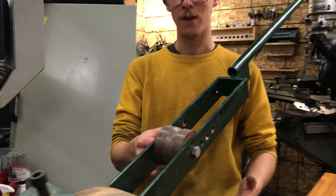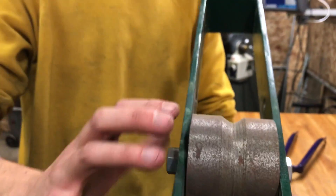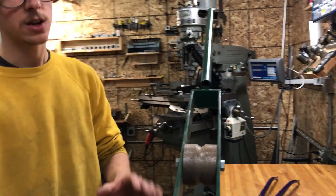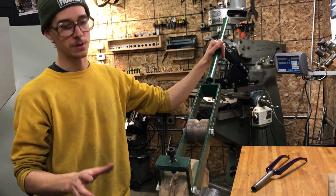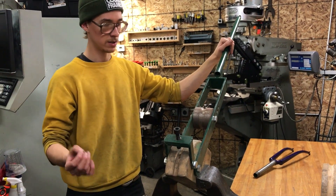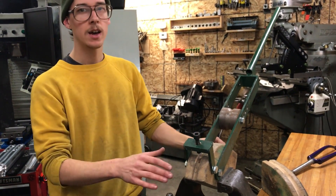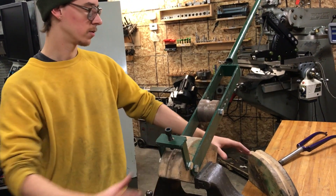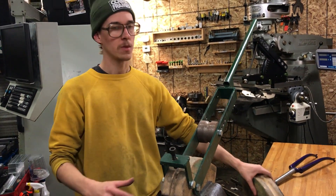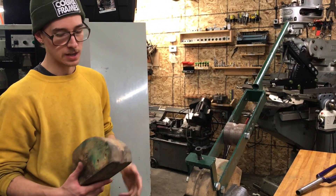These holes are just drilled on a drill press, they don't have the kind of positional accuracy that I do nowadays with machined stuff, but it got the job done. This is a crude tool and it works — there's no bushing, no grease, no bearings, it just kind of fits. The stakes are completely different in this bending scenario than with other bike tubes. If you're just looking to bend the fork blades of a traditional lug crown steel fork, this will do it. When I made this, I wanted options for different radii. If I could do it again, I'd probably just do an 8 inch, or maybe an 8 inch and a 10 inch.